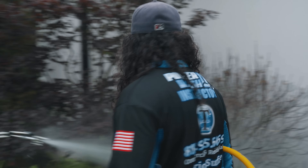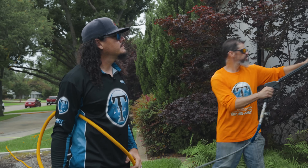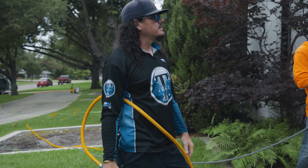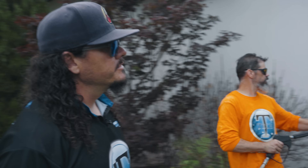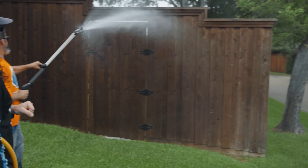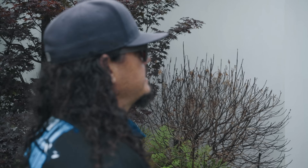There's the pink — party time! We've got a wood fence here; the sealer's starting to look a little aged, so Danny's soaking it down really well. It'll absorb the water and that way when our house wash gets on it it's less likely to leave any light marks where the house wash goes — a little extra precaution.